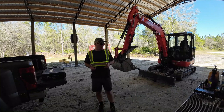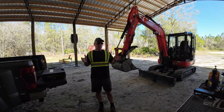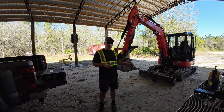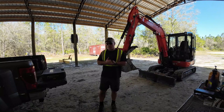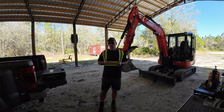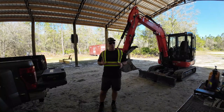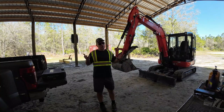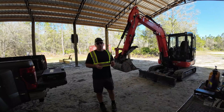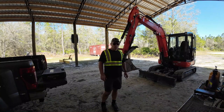Now, the project today is to size them up and cut them. Really, it should only be two cuts, which is cutting the length of each, because I was fortunate the top piece I needed 4 inches, the bottom piece I needed 8 inches. They had both of them, so I got to do two cuts with the metal saw, and then I'm going to use the magnetic drill to bore some holes, which is really cool. I'm glad I get to use that a little bit more often, and then sandwich together. So this isn't a big project, but hopefully it'll work out, because if it does, then saving $4,500 on getting another bucket, because I just don't need it all the time. When I know I have that type of project, sandwich them together, crank on them, and I'm done. So we'll go ahead and get started.